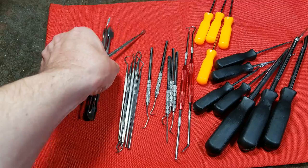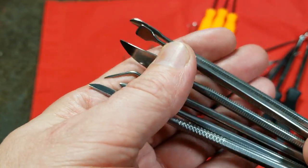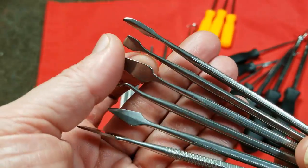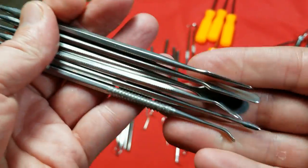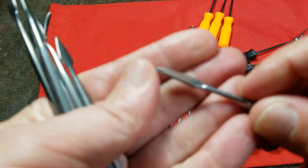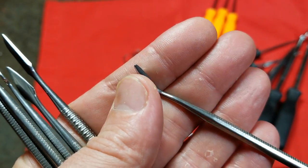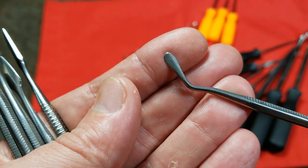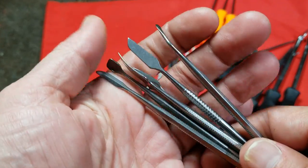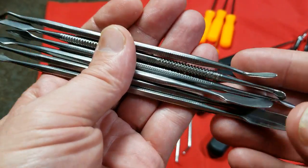This last set is sold as a carving set, but these are just as handy as the other picks because when working with o-rings you want blunt tools. These have rounded, non-scarring, wide spatula-type tools — not all are perfect, but many work great for o-rings. One is a small spatula on a 45-degree angle, another side is like a blunt knife. There's one that's 45-degree with a flat spatula, and one in-line with the shank. These are great for being nice to o-rings, and also excellent for electrical connectors.